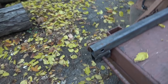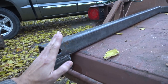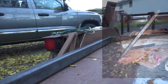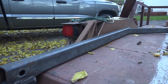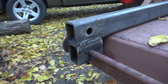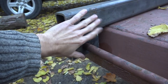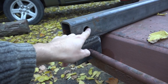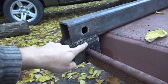I was originally going to just have a pivot on this leg up here on the pin, but when it actually folded down it contacted here and it was way too high in the air to be really effective. It was like four feet in the air, which is way too far. So I added this extra piece on here to kind of offset it a little bit, and later on I'll add a gusset so there's a nice plate on both sides to reinforce this. Now this weld is under stress because the whole thing is pushing down and you get some shear force there.